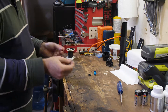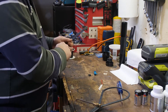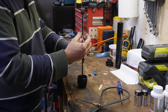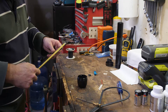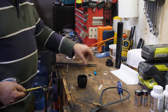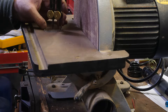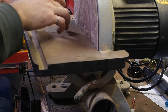The first thing we're going to work on is the emitter and sizing the lens down to size. I need to measure what the inside of that piece is, using a set of inside calipers. The diameter of that is just a little over 40 — about 45 and a half millimeters. And right now the diameter of the lens is closer to 50 millimeters. So we just have to shave off a little bit off each side — a couple of millimeters. I want to mark this — it doesn't have to be exactly centered, just so long as it all fits on the disc.